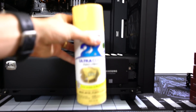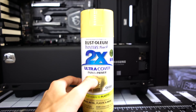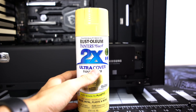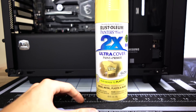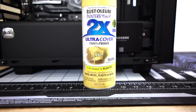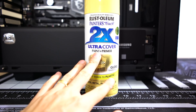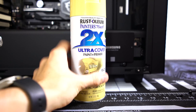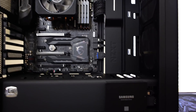The first thing I want to cover is painting, and I'm bringing this up first because it is probably one of the most daunting things you could possibly do with your components. Painting things could potentially ruin them, especially if you don't isolate the parts properly, and it's a pain to get this paint off. I recommend Rust-Oleum Painter's Touch — paint plus primer is important. It'll look slightly glossy versus a matte finish. The important thing is that it bonds to plastic, and most of the stuff we'll be painting is either plastic or metal.